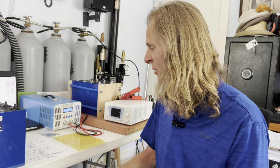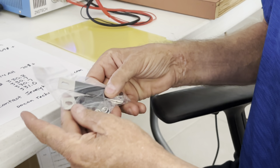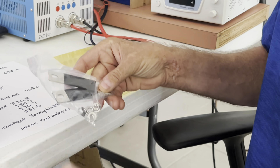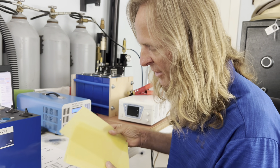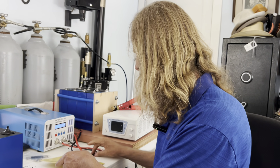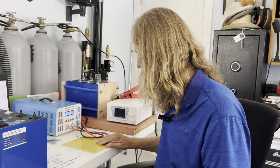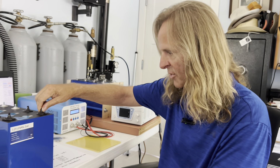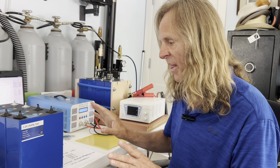Inside they had the typical tinned copper bus bars with the serrated nuts, and they've got shrink wrap on them. They also came with these plastic separator sheets that are cut to size to fit the batteries. This is great — I've been buying thin cutting board sheets from Amazon and cutting them to size myself. These cells also came with little insulators on them.